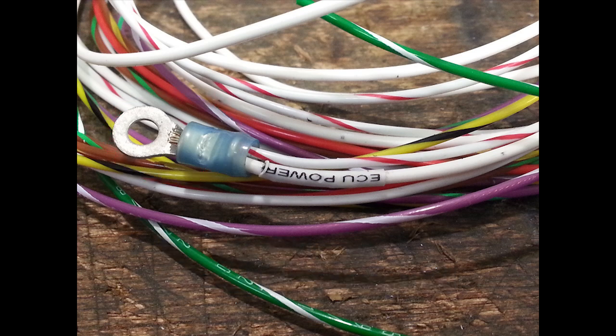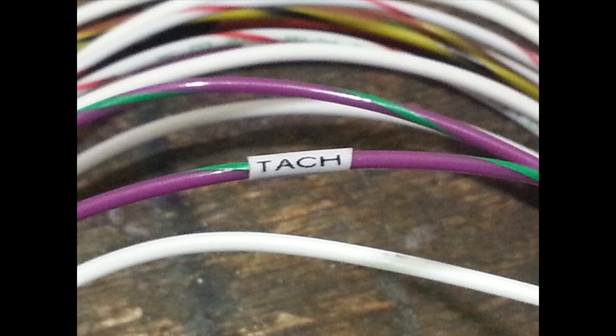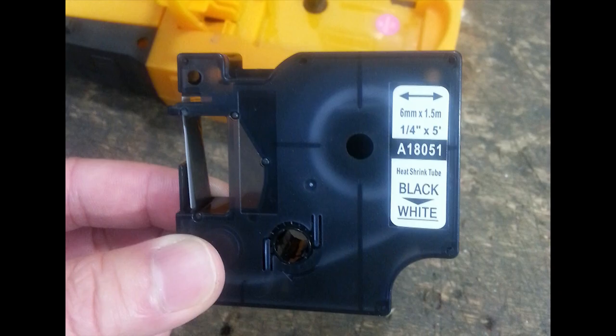This type of labeling does a wonderful job, but I have two personal objections. Number one, you must slip it on the wire prior to putting on your terminations — otherwise you can't get it on, obviously. This makes it impossible for labeling existing wiring. Number two, having to use a heat gun is a pain if your time is at a premium. Here's a close-up of the cartridge of heat shrink labels I use. There are all sorts of Dymo labeling machine models that use these cartridge styles, as well as my inexpensive Label Manager 160.